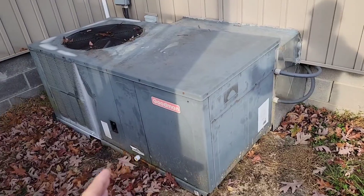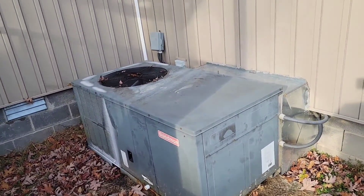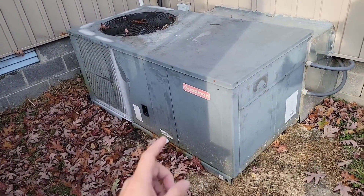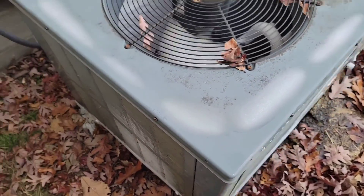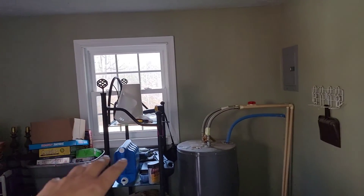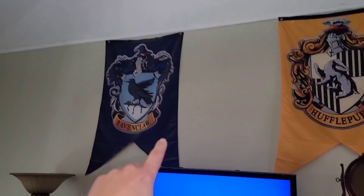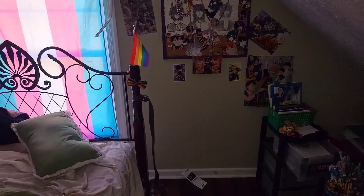We're going to take out this package heat pump and the duct work and install a multi-zone Samsung Free Joint multi mini split system with four heads indoors — wall mount and console unit — and lower that $800 electric bill. I'm going to put a 7,000 BTU wall mount inside the laundry room, another 7,000 BTU wall mount in the bedroom, a 24,000 BTU unit about 10 inches below that trim for the main living and kitchen area, and a console unit upstairs for the bedroom.